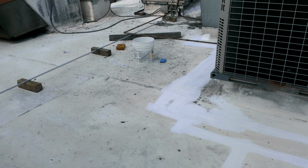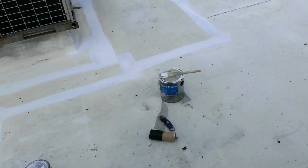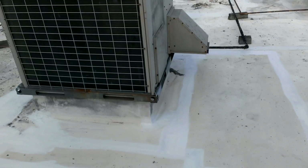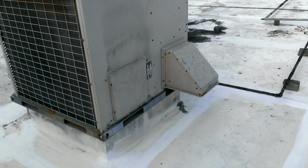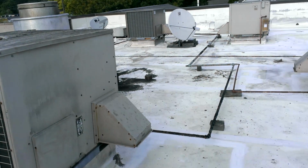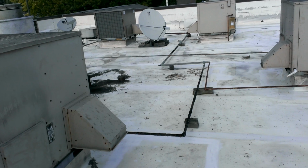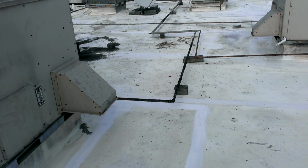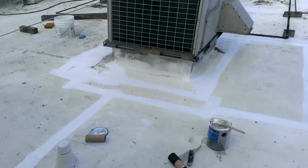The only thing that you may have concerns about is the seams, which sometimes start failing, especially around the air conditioning units, where there's a lot more work, and maybe the people working with the AC units don't have as much skill as the roofing company. So with the years, you start seeing deterioration. Besides that, when you have patches and holes that somebody else has done, you may have some issues. So, for that type of material, I want to guide you through this before you start buying any type of product.